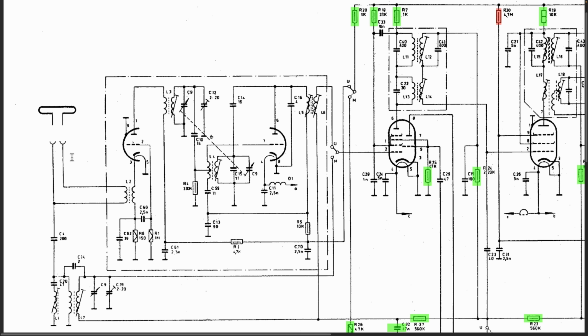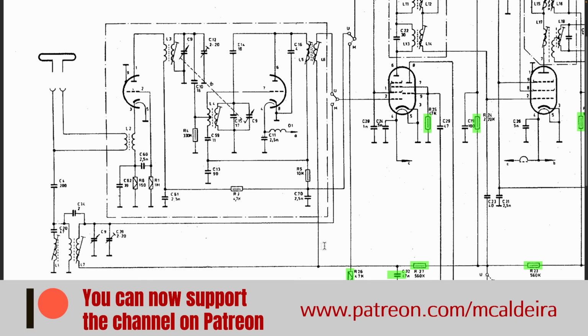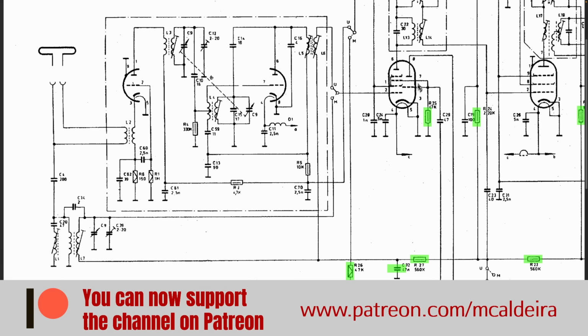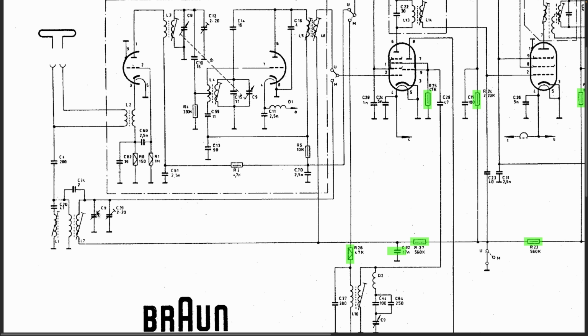We've got the antenna in here. This is the FM dipole. This is the AM section. So the AM antenna is effectively this guy over here. Comes through here, goes through the front end, and then it comes to be mixed. This is really, really simple. Mind you, it's only one AM band, so you don't need much.